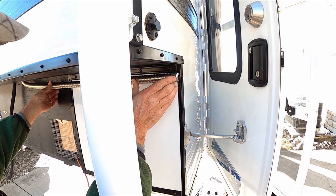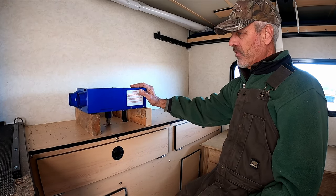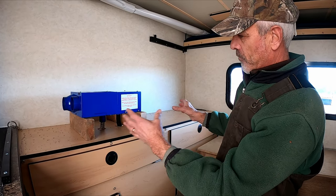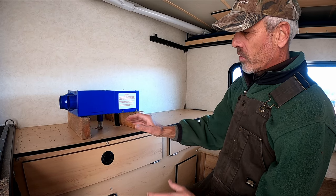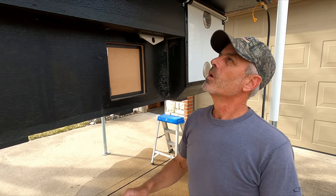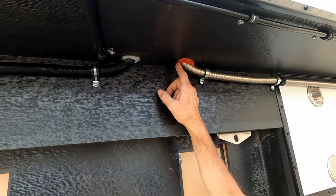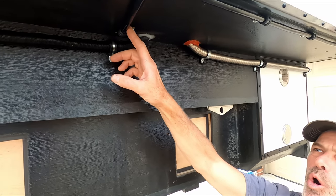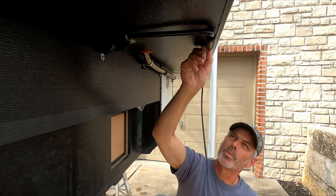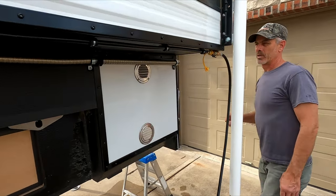Our measurements came out pretty good — we ended up right at the back, which is what we were shooting for. Inside, the heater will eventually be inside a cabinet, but for now we just got it set up on two boards so we can move it forward, back, side to side, and get the proper height needed for our exhaust and intake pipes to run properly. We've got the intake and exhaust tubes mounted using P-clips. On the exhaust tube you have to use a high-temp silicone; on the intake I just used a regular silicone to seal up that hole. I've got the quarter-inch propane line coming out with black tubing around it so it blends in and helps protect it.